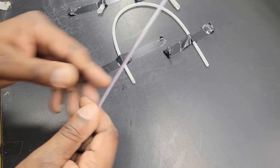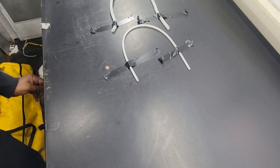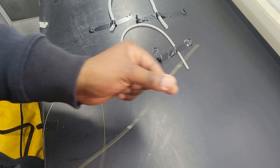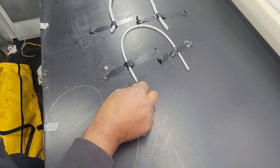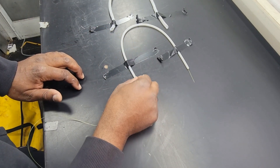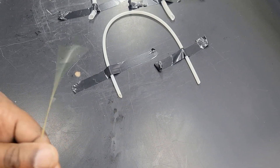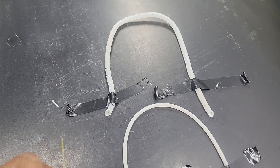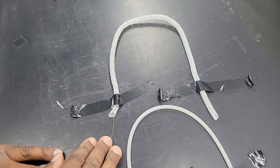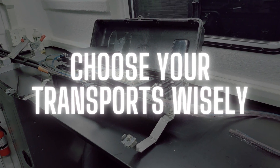Just for kicks, let's see what it looks like with a single bare fiber. We chose yellow — great contrast against black — and we see it goes through the regular transport tube nicely. These narrow transport tubes, you don't want too many going through there — maybe about two to three ribbons at most, maybe about 12 bare fibers. But let's try to force it through the corrugated spiral tube — and it came right out. That's never a good thing. Imagine if it were more than one — leave a comment.